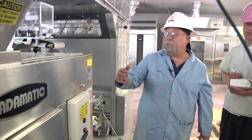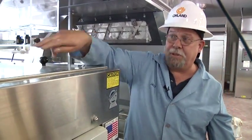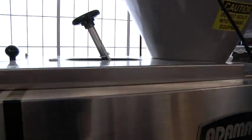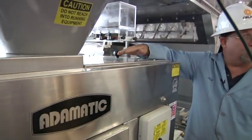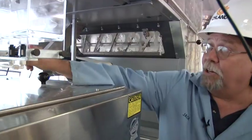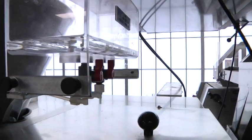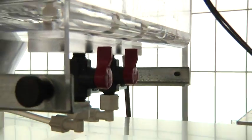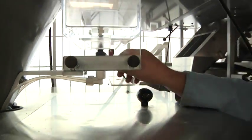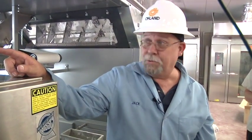While the machine is running, you have an oil reservoir here which feeds oil to the two moving parts: the one going up and down the back pocket, and the one underneath that goes horizontally in the machine. These valves turn on the oil flow to those components. While you're running dough and scaling, those valves should be on. When you're done scaling, have no dough, or shut the machine off for any reason, you have to turn them off. It's a gravity feed system and you'll keep pouring oil into the machine, so it's very important to turn them off when not scaling.